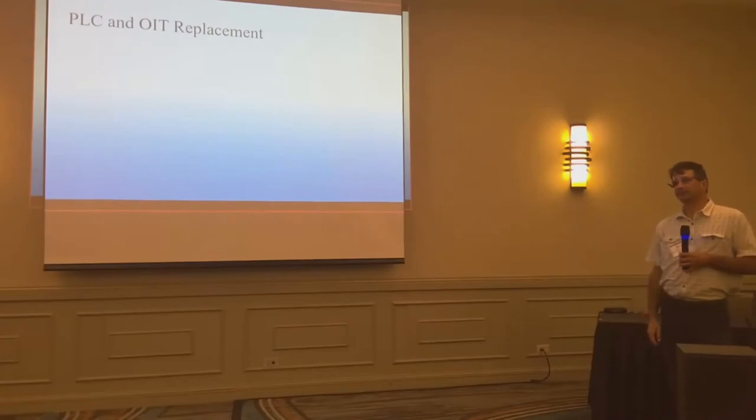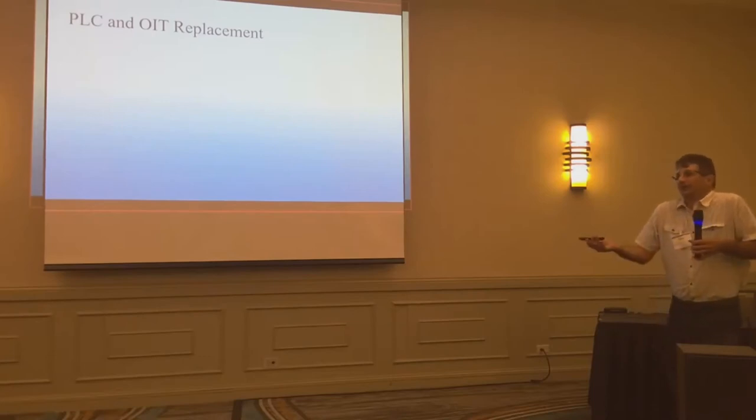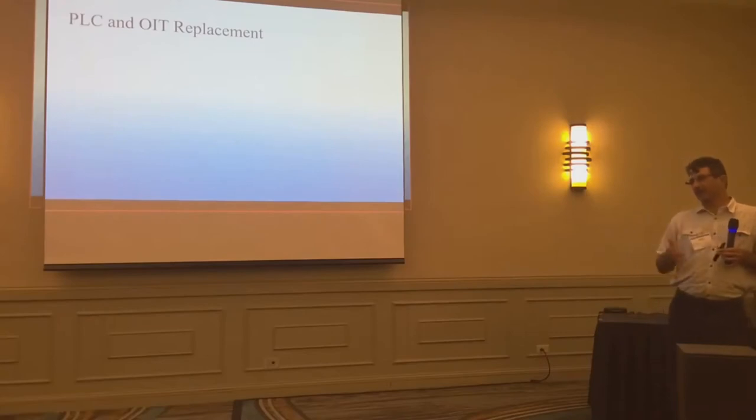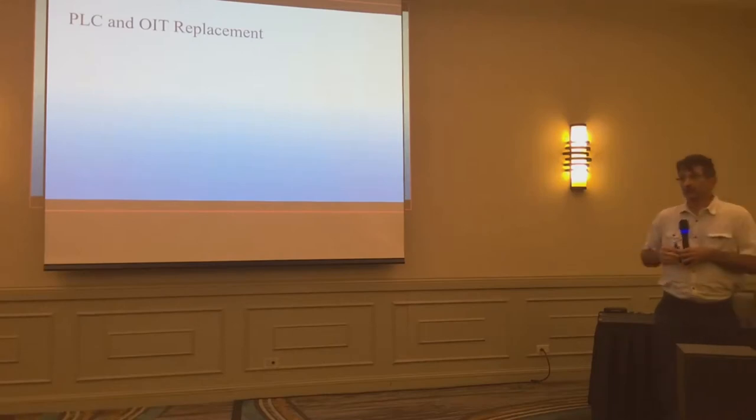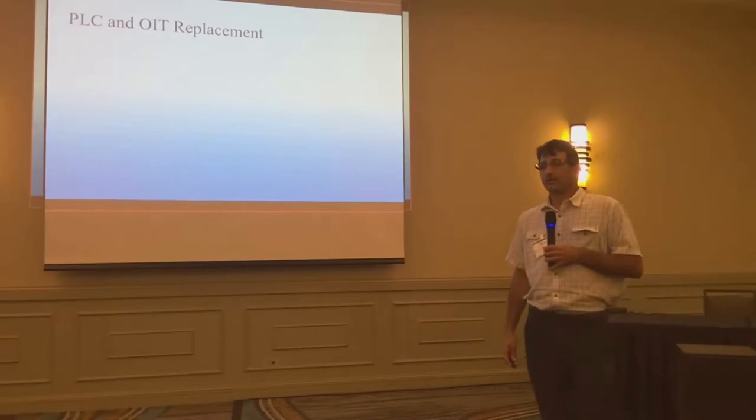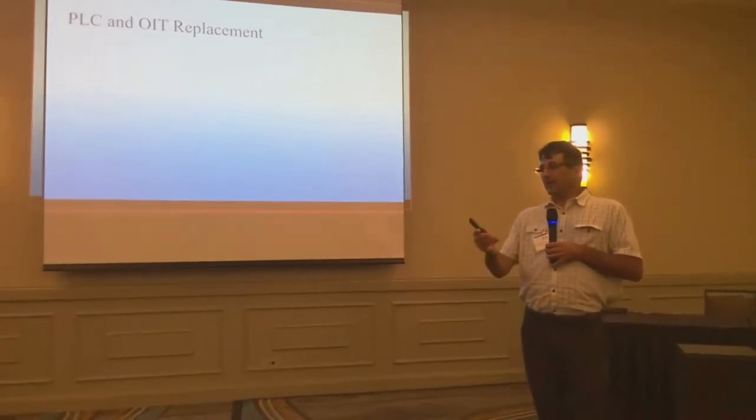So I didn't know if it was to support the weight or no. I mean, I have to see your installation to say for sure. I just, from my understanding, anytime there's a zigzag, it's because the line is too long. The line only needs to be supported every 25 feet on a vertical support. And it's almost always installed in cable tray. You can just drop it down, cut it.